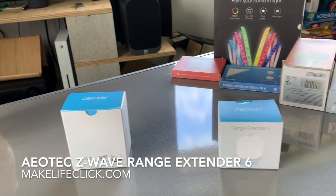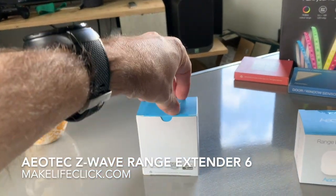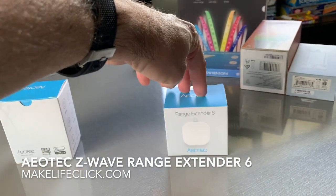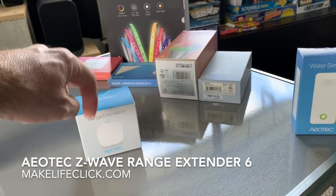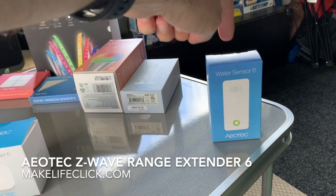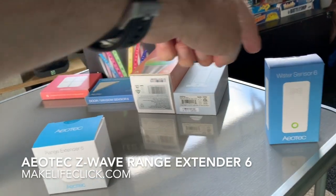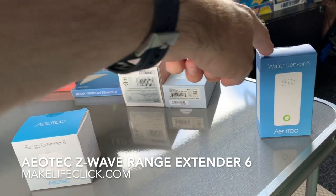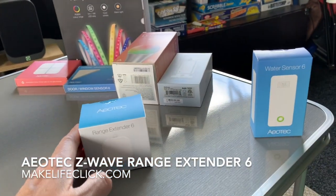But there's one more scenario you should really be aware of. It goes from the hub to the switch halfway down the house, reaches the range extender, which sends out an extra-long signal to the light — and it can reach the light because it's slightly more powerful than other Z-Wave products. The light switches on, but then the light goes to send a signal back to the range extender and it can't reach, because the range extender is stronger going out but the light isn't strong enough to reach back. So the light fails.